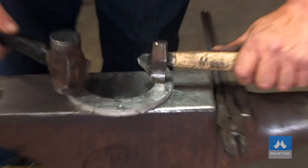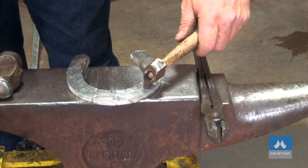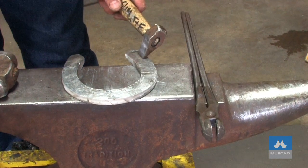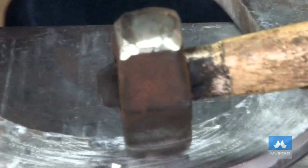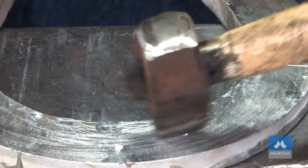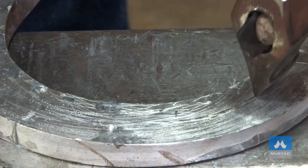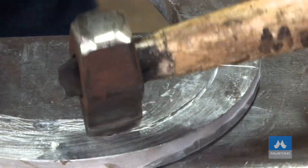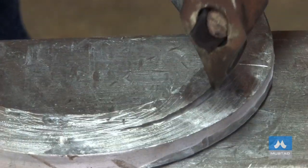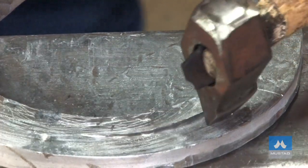The outside fuller ring comes around to about the widest point — that's where the nail hole's going to go. The fuller ring for the extension comes up to the second nail hole. Fuller around to the outside and then have a full stop at the end. I visualize the distance because this shoe's boxed — lateral extension boxed off. As I come around the corner, this fuller ring starts to come in a little. It stops around the widest point. I won't come up to the second nail hole on this one — I'll leave it a bit short because I can always bring it up a little bit more at the end.